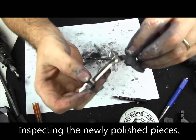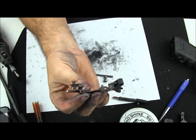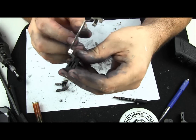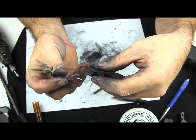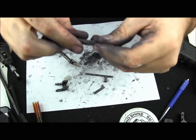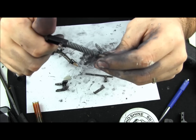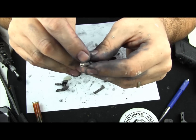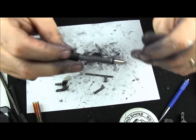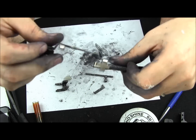When you get into the trigger and the trigger bar, as you can see, we got all of it to a mirror polish — running the Dremel at about 35,000 RPMs. You can see up here on the safety disconnect, all that's completely polished. On the firing pin itself, I went ahead and buffed this whole area up here — mine is a little messy, it's been through a lot. There's actually a little burr here that I've got to get rid of, then we'll go back over and buff it. What I'm going to do is take all these parts, get all the excess polish off, wash them down really good, set everything back up, put it back together, throw a little bit of oil at it, and see how good we've done.